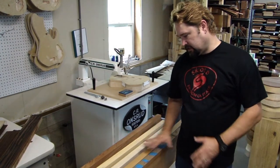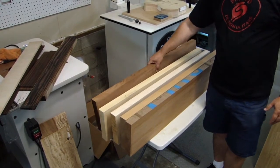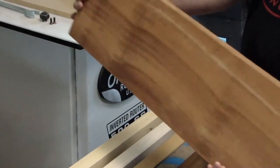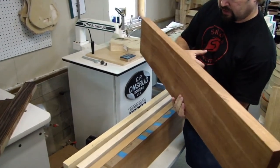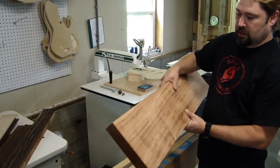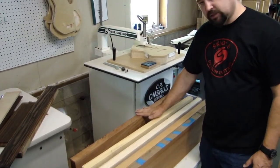These are my typical selections and I have a pretty good idea of what I'm going to get when I use them. Here's one of my favorites: African mahogany. It's a gorgeous wood — this one actually has a lot of figure in it. Generally speaking, it enhances the low mid-range, so if somebody wants a really fat fingerstyle tone, this is a great body wood. It's a little heavier, so weight is always taken into consideration.